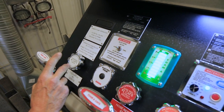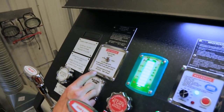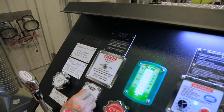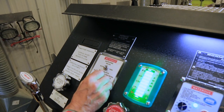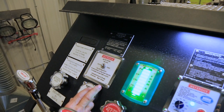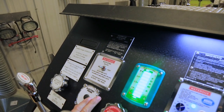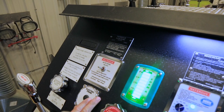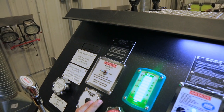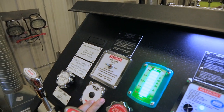The CAFS control system is on this panel. There is a three-way switch. The pump should always be started in unload mode. For use with tools, the CAFS system can be put in the fixed mode, which sets an automatic pressure of 150 psi. With the CAFS in auto mode, the CAFS air pressure will follow the water pressure in the pump all the way from 50 to 150 psi. The best performance on the CAFS is about 125 psi, as indicated on the label.